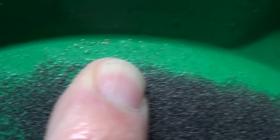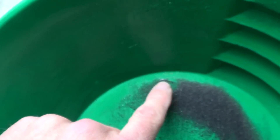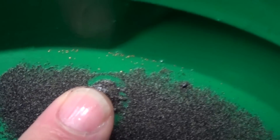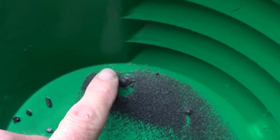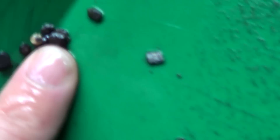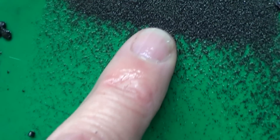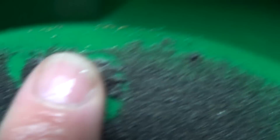Hopefully you can see that — 100, 150, even 200 mesh stuff, just a tiny bit in there. That's what I like to see — a little bit of gold in that last mat. Here's mat number five, second from the bottom. You can see right up in here — same type of thing, 100 to 200 mesh gold. But I did want you to see what I'm battling here: look at the hematite and lead — that size hematite and lead I'm having to battle along with the fine black sand. And that's your gold right in there.